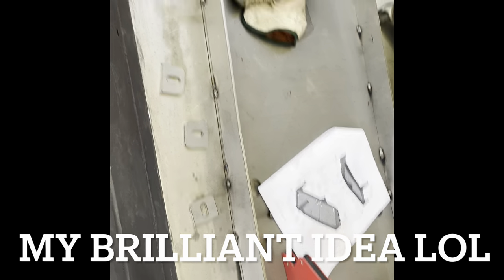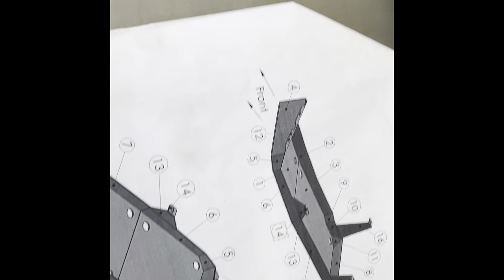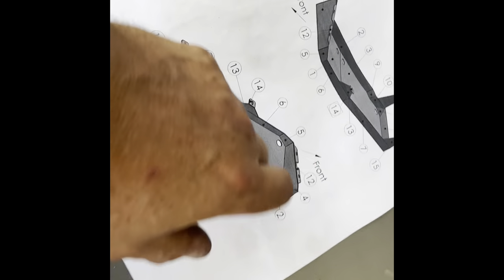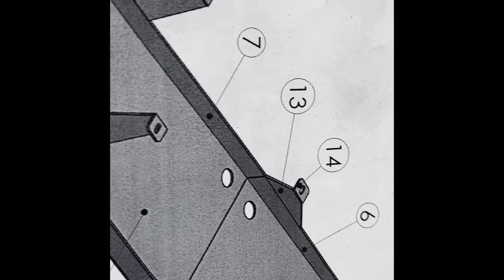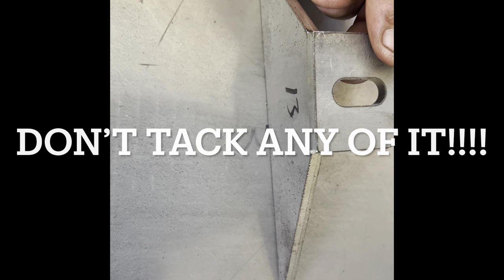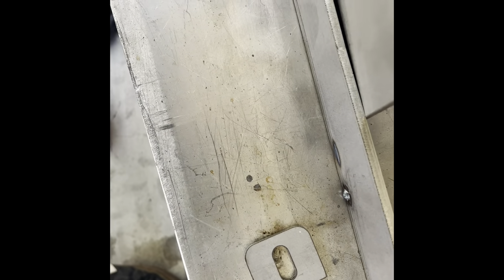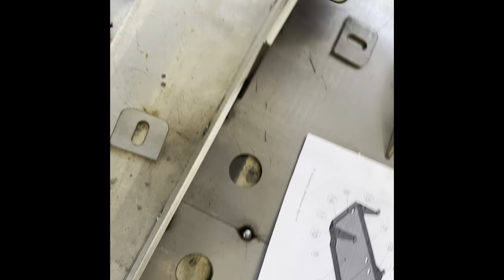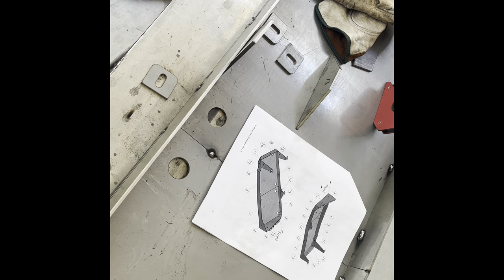I removed the tacks, and what I'm going to do is leave number 12 — one piece up in the front — I'm going to leave that one in place. I'm going to take pieces like number 13 and 14 and just go ahead and weld these together here. So these will be welded and then I'll just put them in place. It'll be easier to tack everything — I believe so. We're going to try it like that.